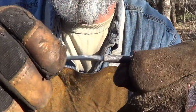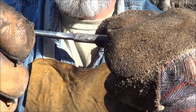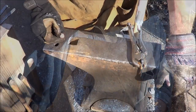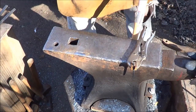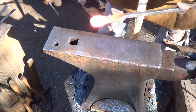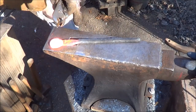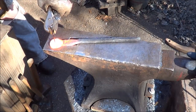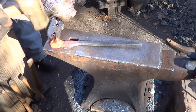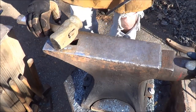While that's heating on this first drift, I went in on the grinder and I gave myself a bit of a radius there at the top just to give that head something to sink into. All right, children, here goes nothing. And by the way, it's been 1 hour since I started this project. Let's hope we can make this happen. I'm a little concerned about my drift. I want it to be square. Come on now, get in there. Oh, sweet. Sweet!